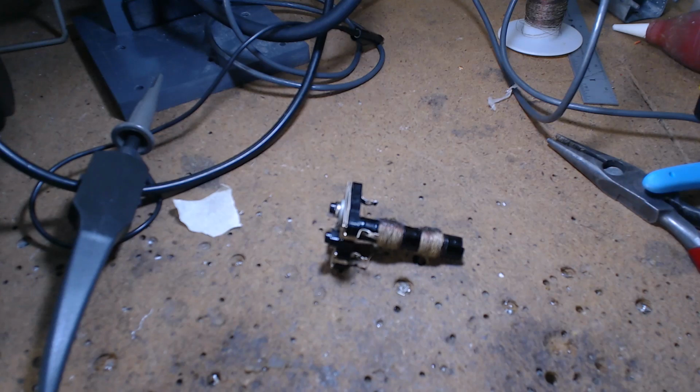And I wanted to say, this wire is cotton covered, single strand enamel wire. And you'll say, why is it cotton covered? Okay, when you cotton cover the wire, it puts distance. When you wrap it over another wire, it puts a little bit of distance between the other wire, which reduces capacitance, which increases your Q. You know, I can show you on my scope how this thing peaks up. All right, but when they really designed the original coil, it has a better Q than the one I just built. But it's good enough to get the radio working. I won't call it a resurrection, but that's basically what it is.